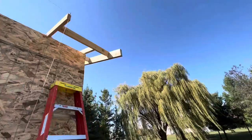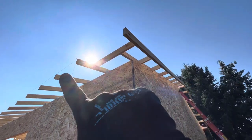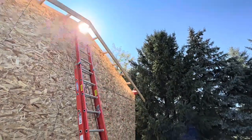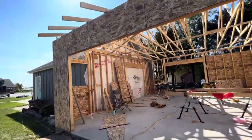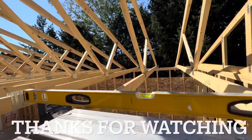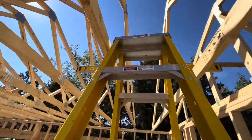Here's an outside view — this is basically my version of a ladder setup. The fascia board will go on here. It's a one-foot overhang to the edge of the fascia board. This is how you do a drop end gable, and I've got to do the same over on the other side. And that's a wrap — I'm getting swarmed by bees right now, so I'm calling it quits!